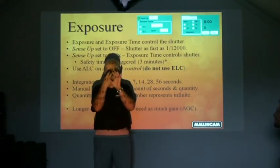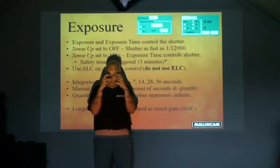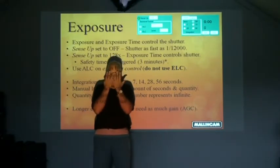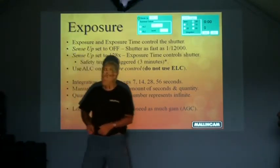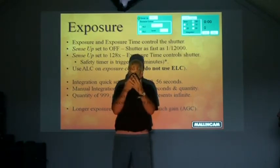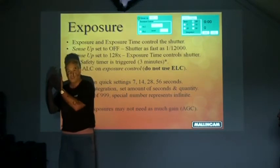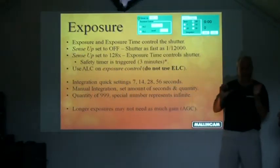All the photons hitting that CCD, all the little CCD sensor dots there, pixels, right? And then once I've done collecting all those photons and storing in memory everything that I've now built up, I'm going to show you that picture. Then I'm going to do it again. I'm going to collect all those photons. Once I've done and stored that in memory, I'm going to get rid of the last picture I showed you and give you this new picture. That's integration. It's not stacking. Different.